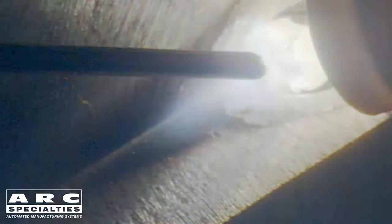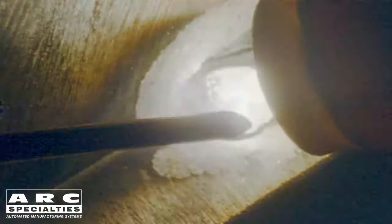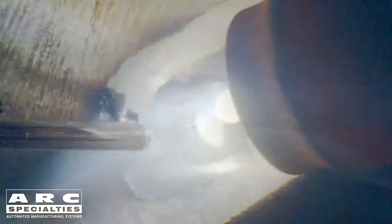You can actually see that cleaning action ahead of each of the weld beads on the video here. So today we're doing a fillet weld on 6061 T6 base material. We're using a 4043 wire. Now 4043 is a little bit easier to work with than the 5356, the other common joining alloy. It has a lower melting point and it tends to wet and flow better. The tensile strength is a little bit less. The reason I'm doing fillets today is these are surprisingly difficult to get good fusion at the root.